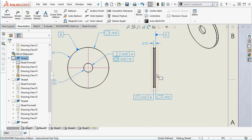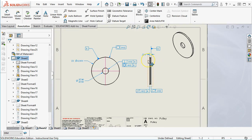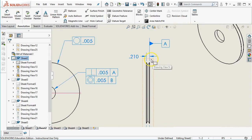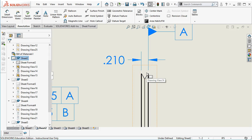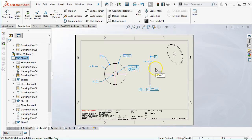Okay, so the question on this one became the V, and if I need to control it, so let's go ahead and save the document. If I need to control it as a GD&T, is it a critical dimension? And the answer is probably not. I can dimension this with standard and give it a plus minus location. My suggested measurement strategy would be to put a 1/8 inch pin in here and measure for center, and then measure it at a couple of points around the part to verify that we got to location.